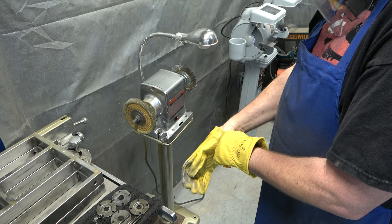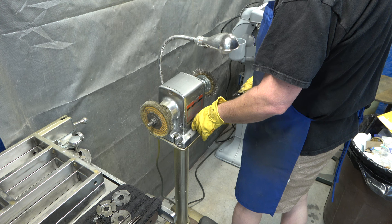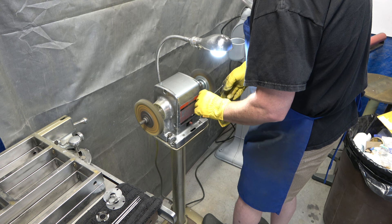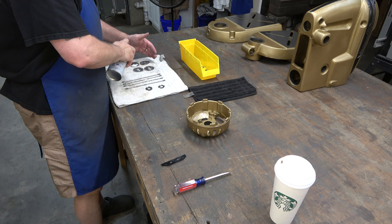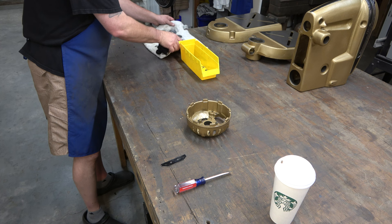That wraps up fabricating the terminal bar. Now we're cleaning up the metal parts for the motor — just using the wire wheel on them, and you can see how shiny they are. Finally, we coat them with Super Lube and dry them off with a towel, and that's going to wrap up this video. I hope you enjoyed it — if you did, please like and subscribe. Part 12 will be coming soon where we will start to reassemble the drill press. Thanks for watching and I'll see you next time.